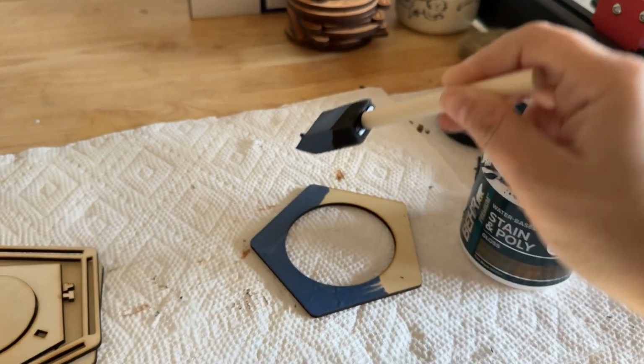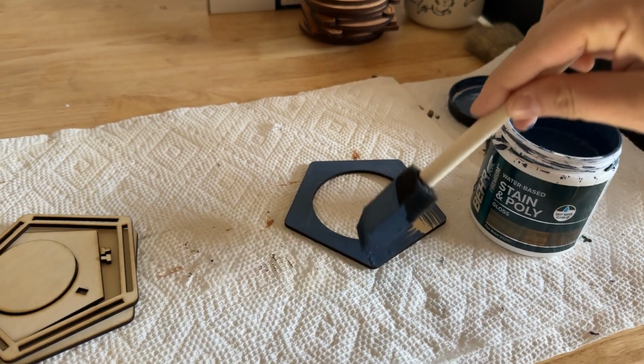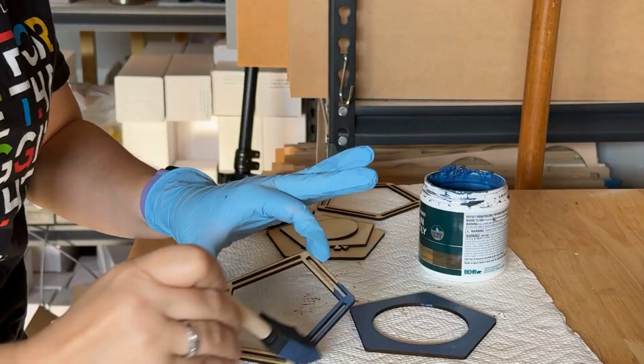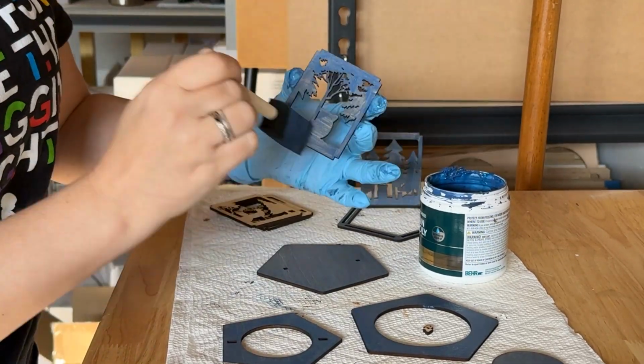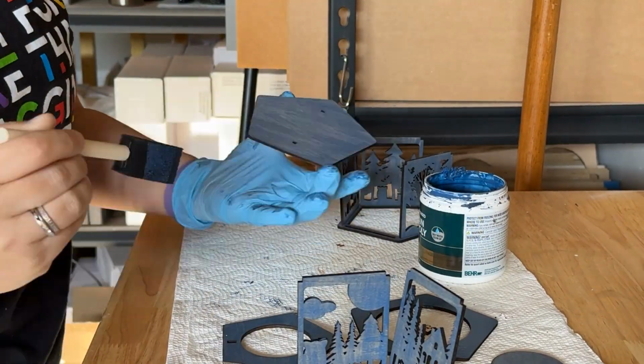If you opt to use these, bear in mind sometimes bits of the foam come off and stick to the stain. You'll want to pick those out of the stain before it dries. I only applied a thin coat of this North Sea wood stain by Behr. It's one of my favorite stains, followed shortly by their Mission Oak one.